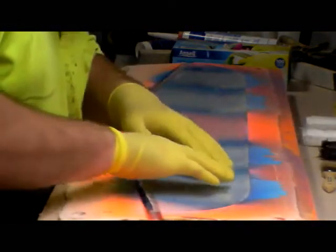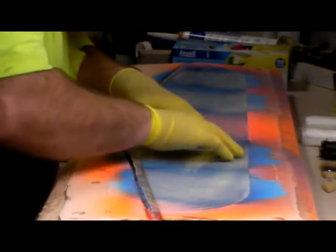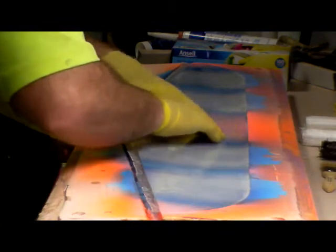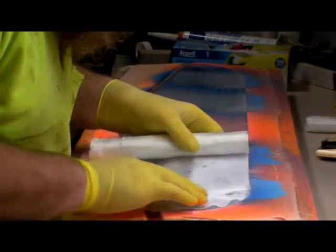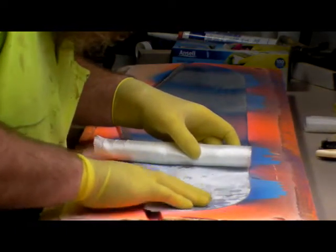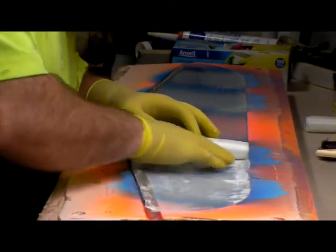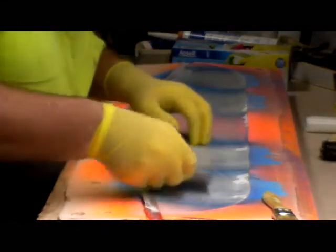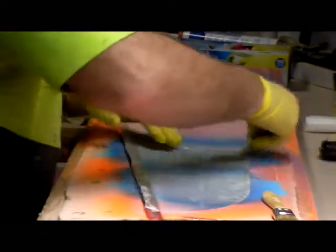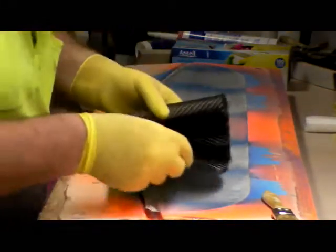Now I've got everything wet out of the two ounce, I can just push and pull the glass so that it's just down from the edge and the front of my mould. It's quite easy to push and pull around because it slides quite well when it's wet. I'll drop my four ounce on there. Once all that's rolled out, I'll just run over with my little roller again. Now I'm going to put my first layer of carbon in.